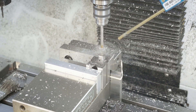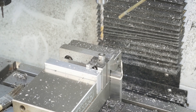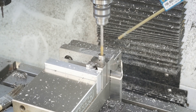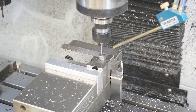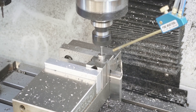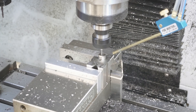After I get the holes all drilled, I get the top faced off and get the little keys in there - it is time to do the tapping. If you've ever tried tapping titanium by hand you know it can be a very frustrating and difficult process. I've never really been successful doing deep blind taps in titanium. It's very springy and when you put the tap in there it doesn't really cut as much as it just bends inside. It's a really terrible process no matter how much oil you use, so I just opt to thread mill.